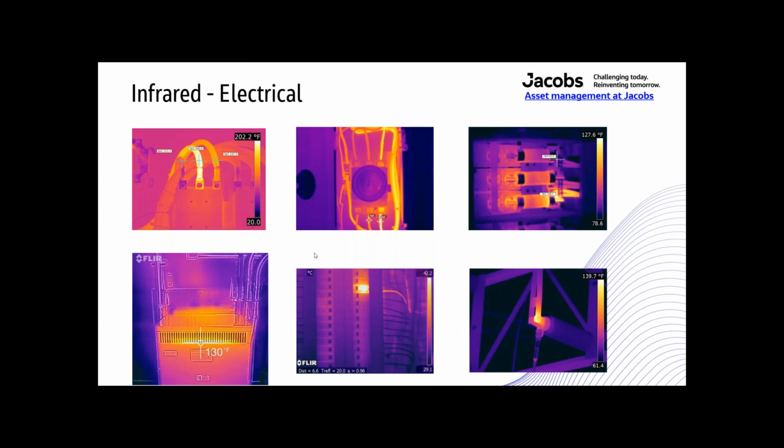All right, and these are some typical electrical deals. Just typical exceptions that you would find just about anywhere, in just about any infrared inspection. So loose connections, overloads. This is an overload because you can see the temperature, it's got a higher load on that phase anyway. And then your fuse, probably a connection issue, either a wire connection issue or the fuse clip right here. One of the two is causing that heat.